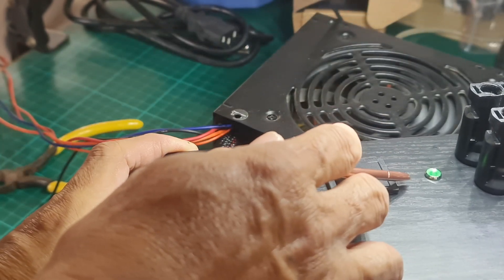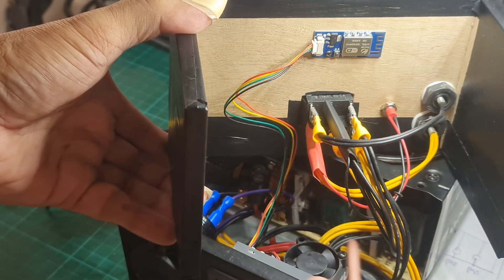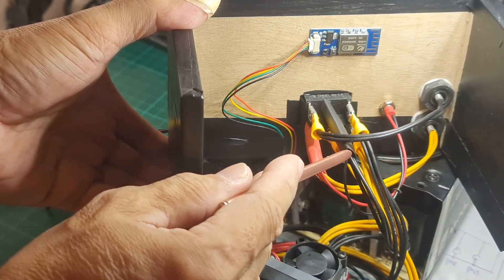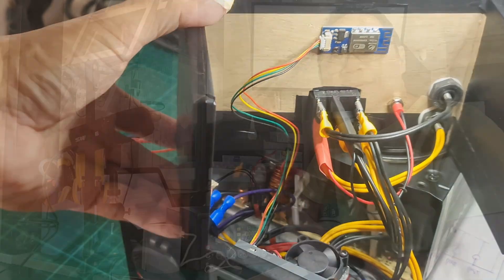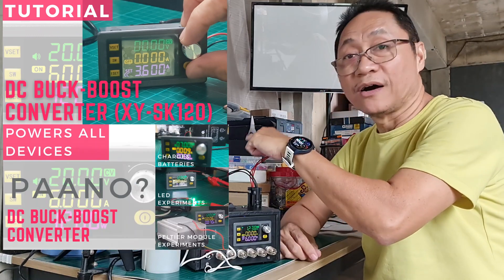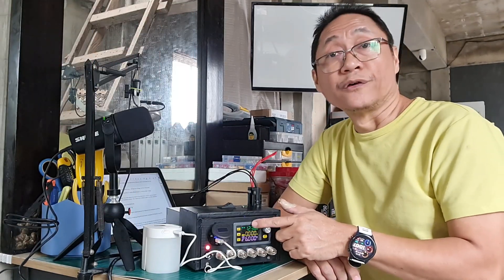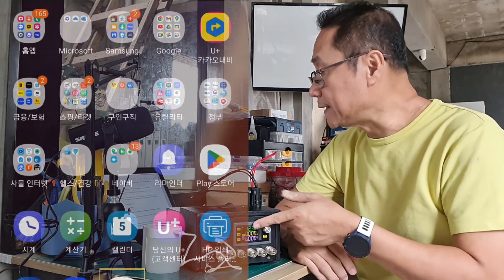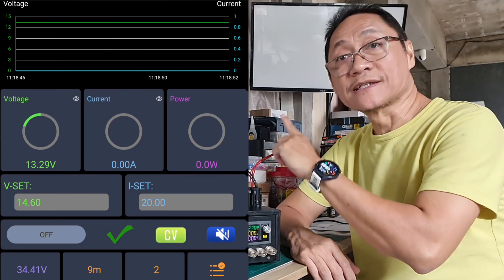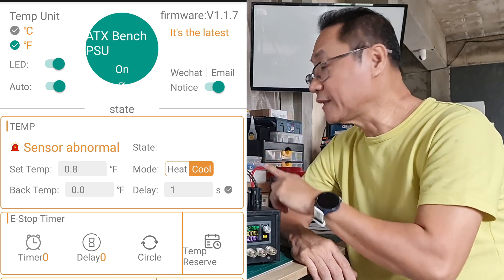In order for this LED pilot indicator lamp to function as intended for solar mode, I connect the positive terminal of the lamp directly to the positive terminal of the solar panel, and the negative terminal of the lamp is connected to the negative terminal on the common terminals of the rocker switch. To know how to set up this converter when using solar panel and how to use the controls, refer to the linked videos. As for the Wi-Fi capability of this converter, I need more time to decipher the application because what is displayed on the app is different from what is expected — the interface is really different and not the right display.